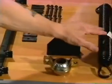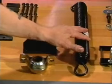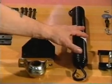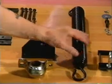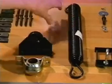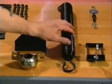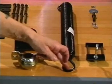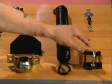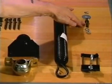The table itself is counterbalanced by 2 heavy springs, one on each side. These are on there to make it easier for the motor to bring the table back up from the 180-degree position. One end of the spring is anchored to the table torque tube weldment, the other end to the frame of the machine. Some of the problems that can occur would be the anchor point separating. So we have repair kits to replace the anchor point on the torque tube weldment and also to replace the anchor point on the frame of the machine.